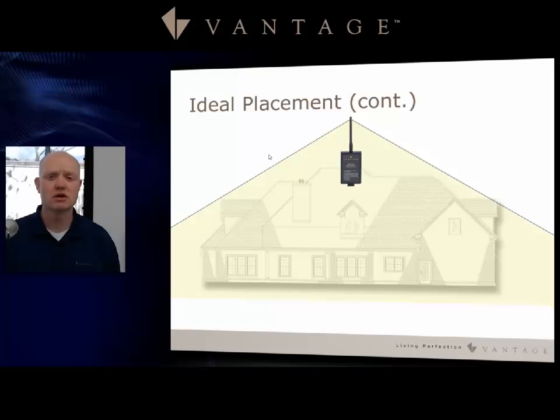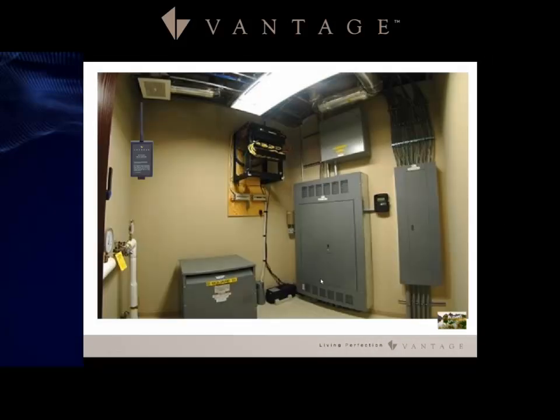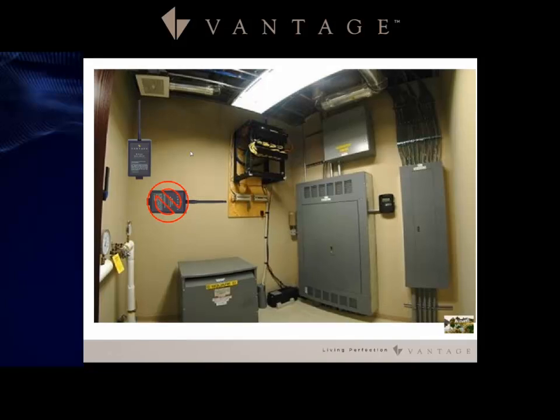We have seen projects that cover a much larger area than that. If you've got some challenges, go ahead and try it — see if you're able to make a good stable connection. Depending on the attenuation or interference, you may get much larger than the 200-foot radius. Also, keep in mind these antennas are designed to be placed vertically; placing them horizontally reduces range. Place the antenna as far away as possible from metal and high-voltage wiring.